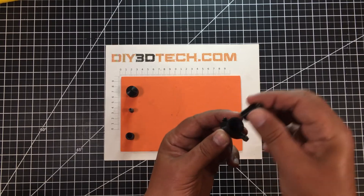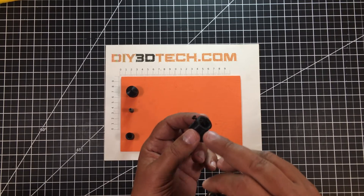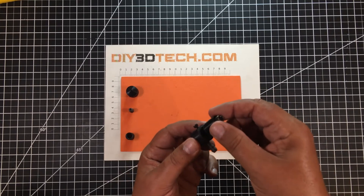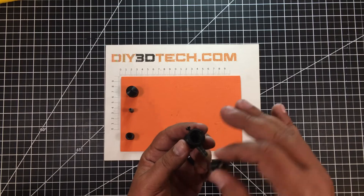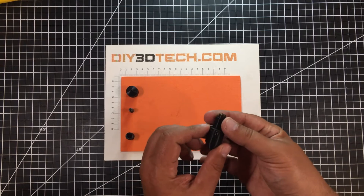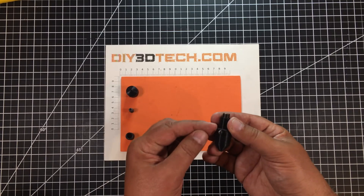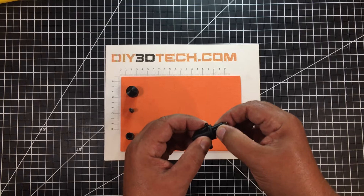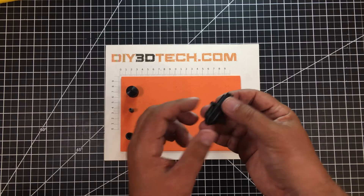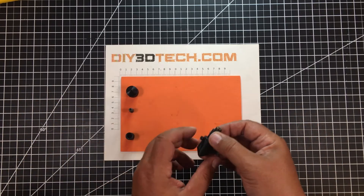Once it's focused, you slide the air cap on. The lens holder sits on a ridge inside here — one of the challenges is that ridge is so small that support material can affect the connection, so it has to be perfectly flat. This basically squares up in there, and you have an M3 screw where the threads are modeled into the air nozzle. This tightens on with basically no play — it has to be pretty snug so the beam goes through that tiny hole.